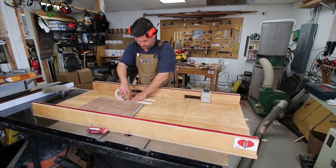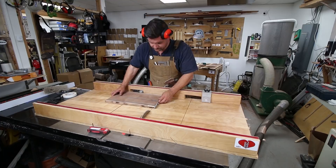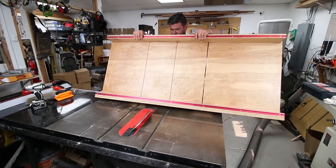In the middle of the top slab, using some double stick tape, I identified a centerline again and squared it off for a guideline. This is going to make my two sides parallel and allow me to trim off both sides square, and then give a heavy 45-degree chamfer to lighten the look. I then changed over the runners on my multi-sled to cut the 45-degree chamfer — I did a great build video on this, I'll leave a link down in the description.